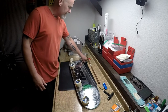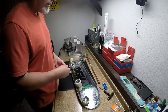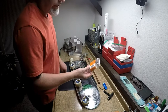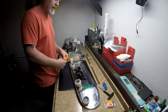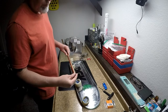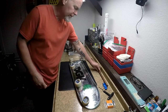Two of the bolts I got are 5-inch. The other two are like 4-inch or 4.5. I was going to put the shorter ones here. I have the ability to cut all of this stuff on the lathe. Okay, so I got regular skateboard truck bolts here. And then I got these bolts to adjust the length out on these threads that I want. And I can basically cut off as much as I want. Then, at the end, I'm just going to cut this copper pipe. It will slide right over the bolts. And so this is going to look like the axle that the wheel is going to basically be attached to. So hopefully this will work out.